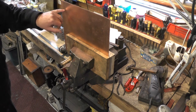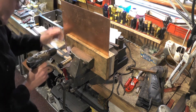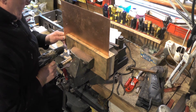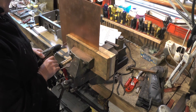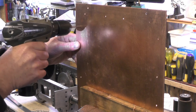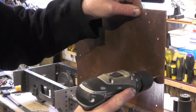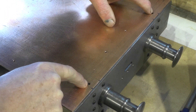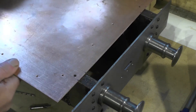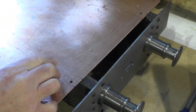I'm just going to drill these three by hand. I'm going to run the 4BA tap through these holes now. I've just transferred the holes into the chassis and I'll be drilling and tapping them M5. I've now got to put a clearance drill in these four fixing points.